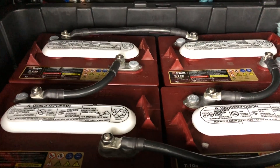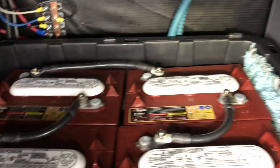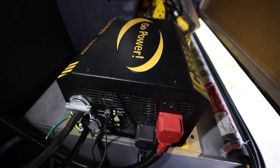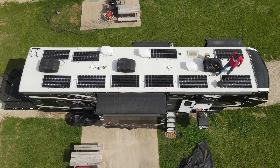We've also found some problems and we're going to cover those. We've had a lot of iterations of our power system over the years in this RV. The very first thing we installed were Trojan T105 golf cart six-volt deep cycle batteries to replace the small battery that came with our RV. We then added the Go Power Inverter — a 2K at first, then upgraded to a 3K inverter. Since then, we've added more batteries, solar, and upgraded the inverter.